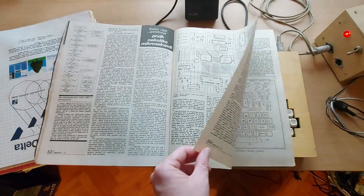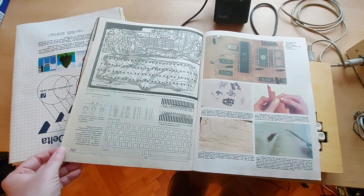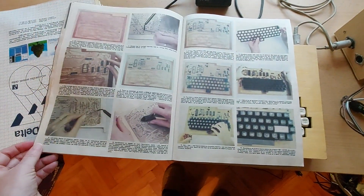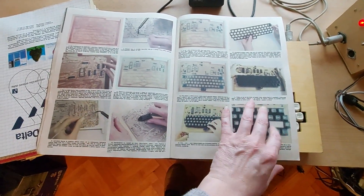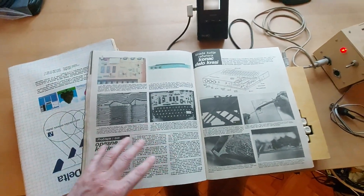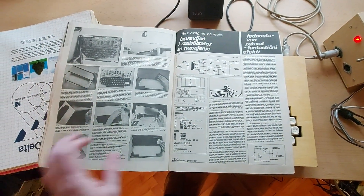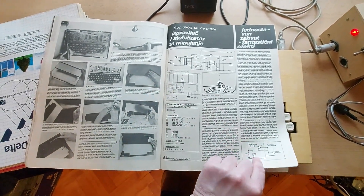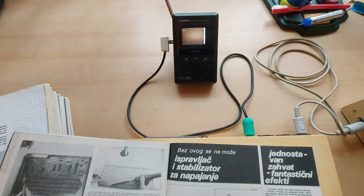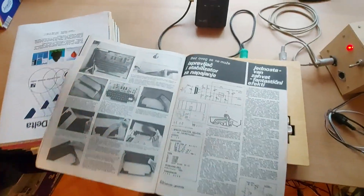There's a schematic and the comic 'Galaksija', and then there are schematics and instructions for what you need to do and how. This is basically what my dad used to build this computer, and it's available online as a PDF — I can link it. I also read about how to add composite output instead of an RF modulator, which is what I'm now using with a little Casio TV.